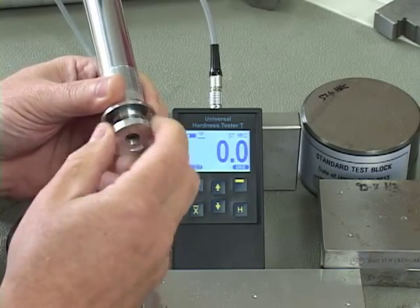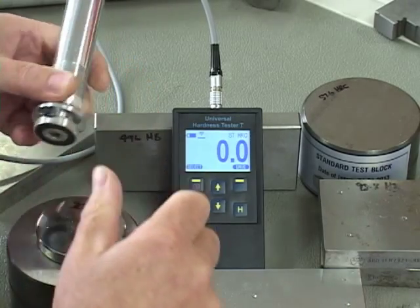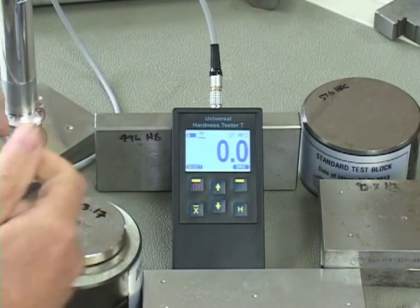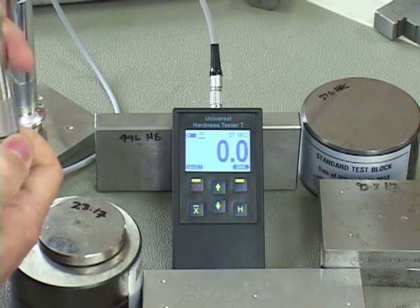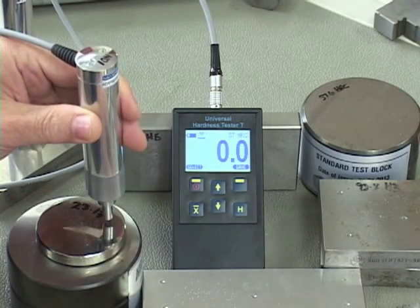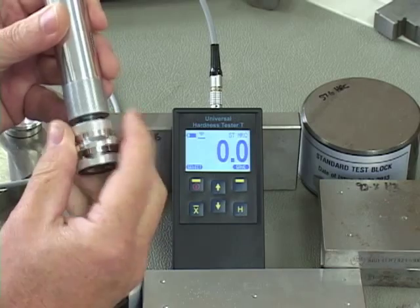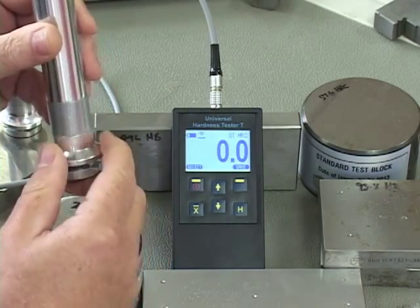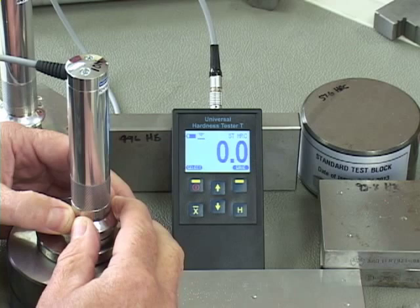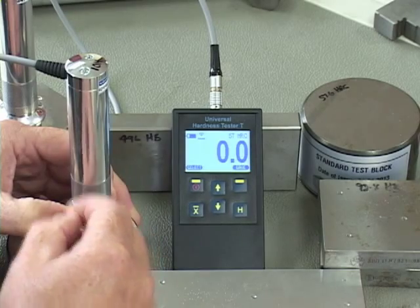While we're talking about the UCI or ultrasonic puck, let's look at the 10N probe. Without attaching it to the device, it looks exactly the same as the 50N. The difference is when the puck is screwed off, this requires only about two and a half pounds of force. You can very lightly and quite easily just press down because it requires very little effort. The same two-step still applies with the puck attached — take the resistance of the spring, press down, and the secondary resistance must be taken up in the diamond tip and the vibrating rod pushing up inside the body.